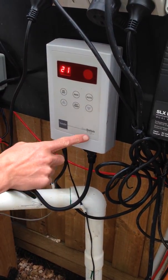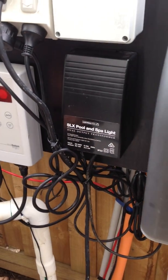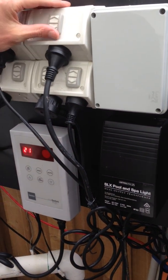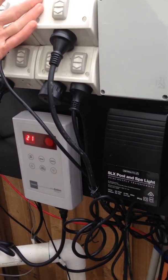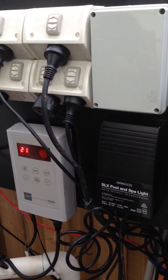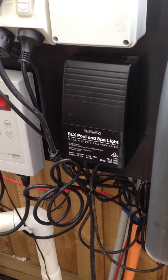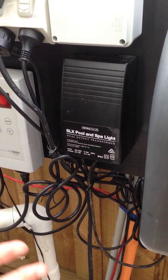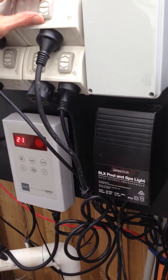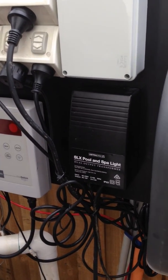And there's some more information, as I said, on our YouTube videos. Next to this, you'll see we have our pool and spa lights. This is the transformer and they just plug into one of our switches, our power points here switched on or off. We normally switch them internally inside - so this one's controlled internally, so I have it on here all the time. And when someone switches the internal switch on or off, it switches the pool lights on or off accordingly. Those pool lights are able to be changed to different colors and different modes. They can do some flashing modes and about six or seven different colors. Just by flicking the on/off switch on and off, it'll change color, change color, change color, and go through a circuit back to the color that you started on.